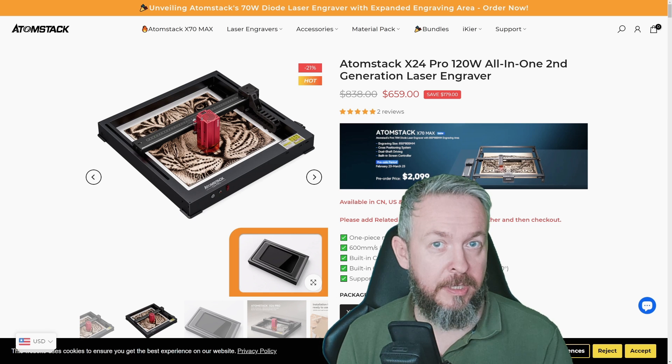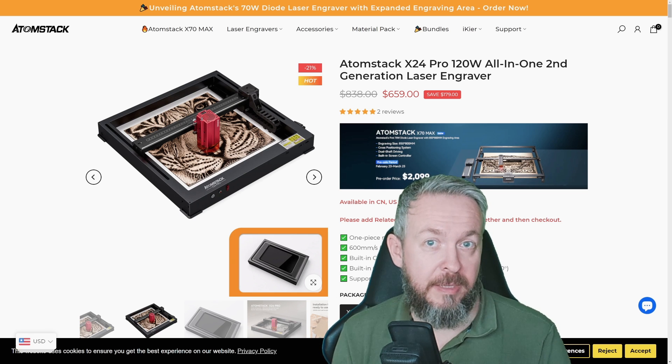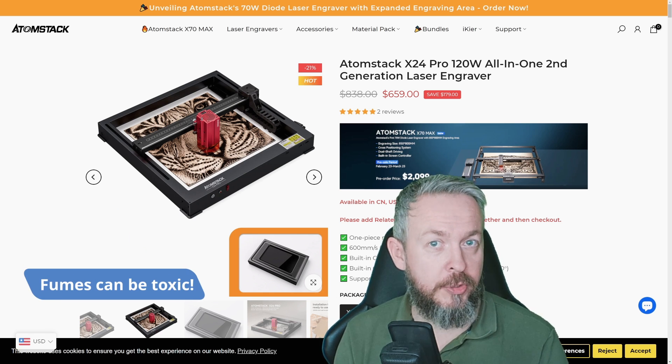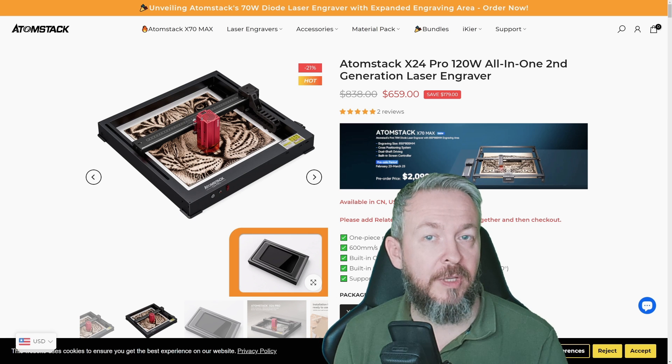More importantly, let's talk about safety. Always wear protection gear when around equipment like this. Glasses are included in the kit, and if they are included, they should be used. Also, always operate the laser in a well-ventilated place. I've been operating it outside on the balcony, and the balcony and all of my neighbors' flats were filled with smoke. Especially take care in a closed space. There is an enclosure you can buy separately and hook up to ventilation to vent everything outside.